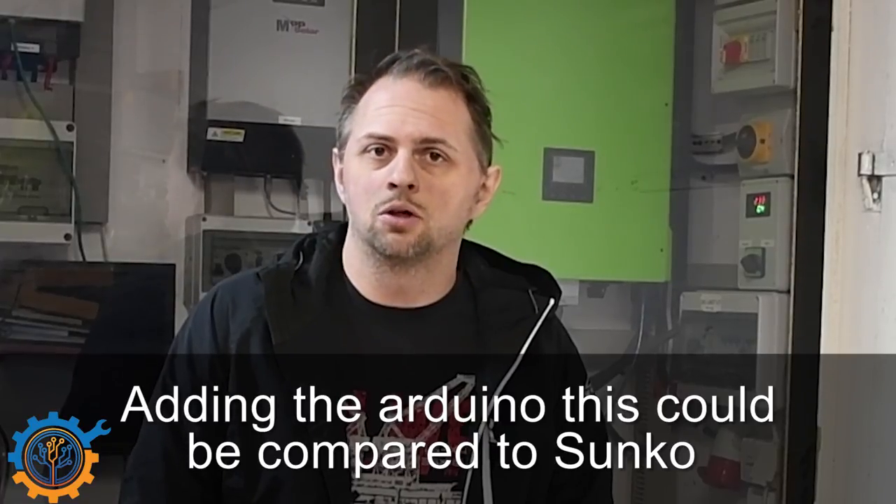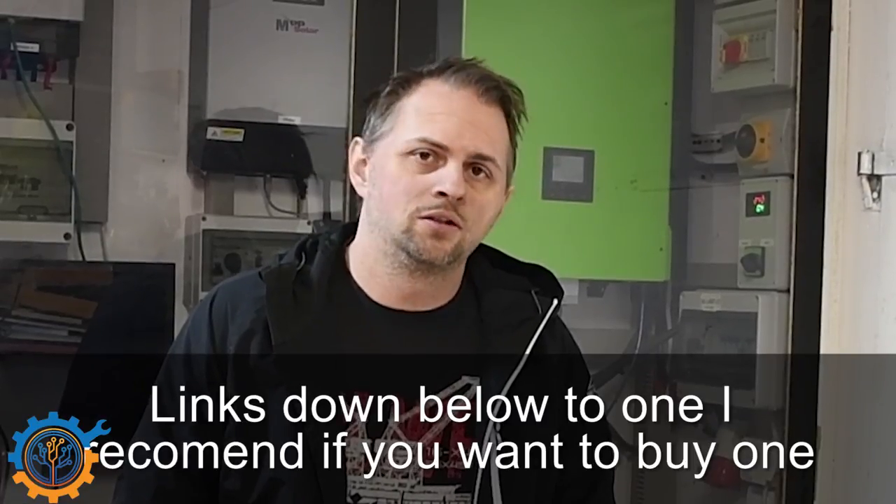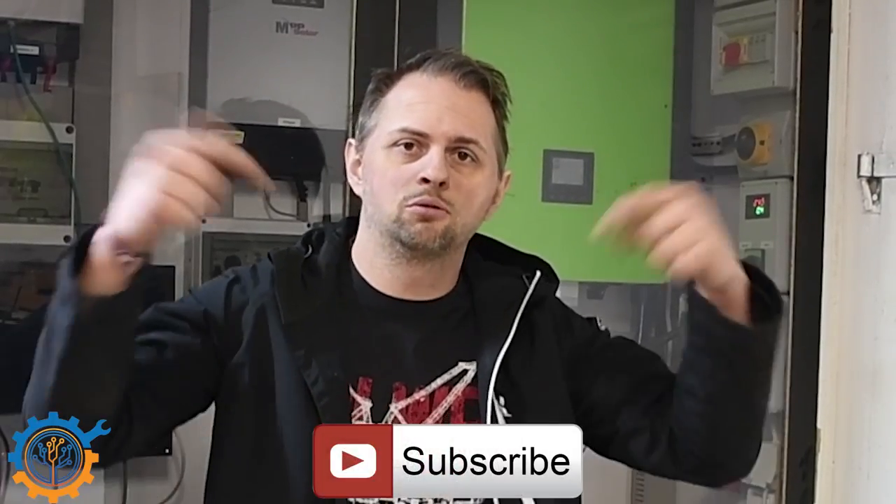I really hope you enjoyed this video. Today I created a very simple spot welder that could be used for your 18650 cells. The spot welder I did today was very simple — a very manual version. I am considering in the next episode to add an Arduino or some kind of microcontroller that actually controls the time it's on. By doing that you will get a lot more consistent welds. You can also switch out the handle to a bought handle, which will make it easier to work with, because the handle I built today has no springs in it, and with no springs you may get issues with having the proper pressure. If you haven't subscribed to my channel, don't forget to press the subscribe button down below. I will see you in the next video — thank you for watching!